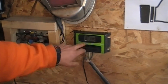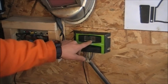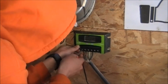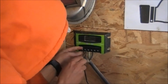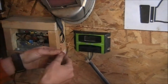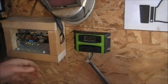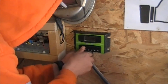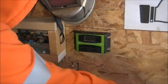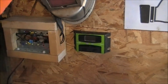I'm going to show you real quick — the batteries are at 13.8 volts. It says it's in nighttime mode so it's not even taking anything in right now, less than one amp of current going in. I'm going to disconnect the solar array first, making sure not to touch these wires together. The smart thing to do would be to disconnect your solar panels or pull the fuses, but I'm going to put proper connectors on the ends. Make sure the battery cables don't go anywhere near each other — white is my hot and black is my ground.